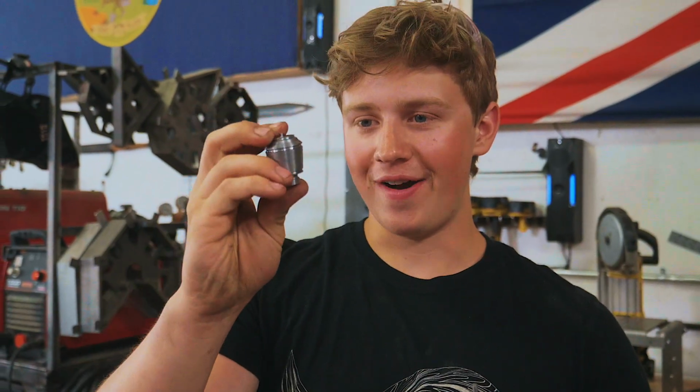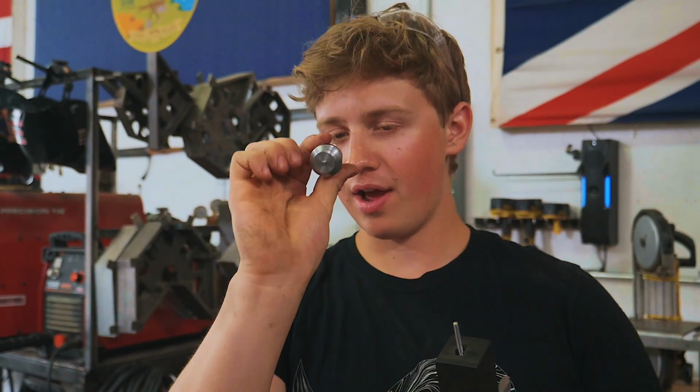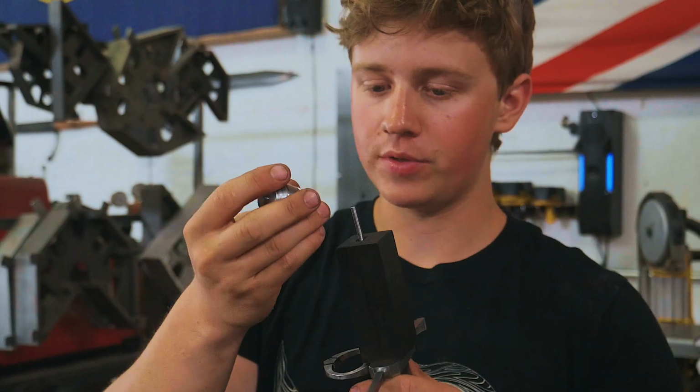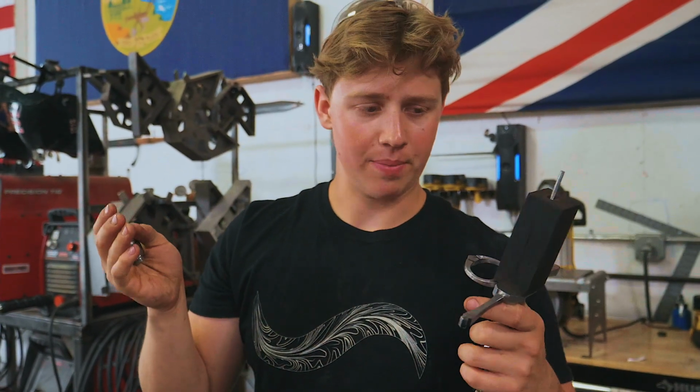And then we're gonna go ahead and do a little bit of work on the pommel and ovalize it, because right now it is round. Obviously it just came off the lathe. And we need to make this thing an oval so it'll fit the rest of the handle shape a little bit better. So threading, grinding, those are the next couple steps. Let's do it.